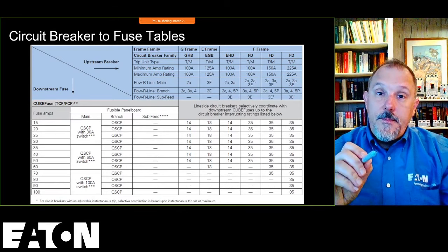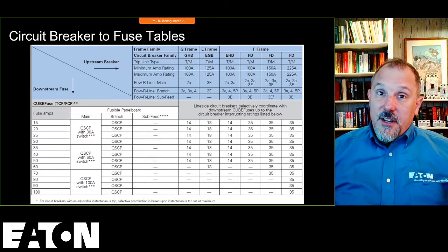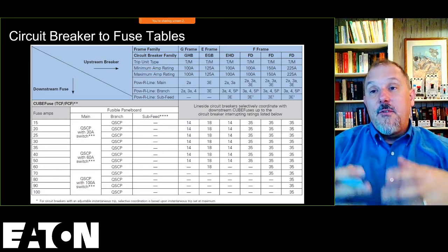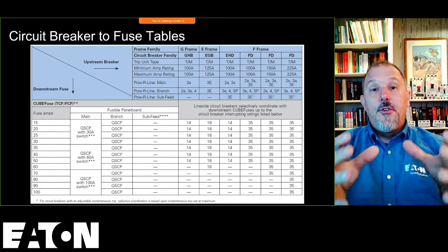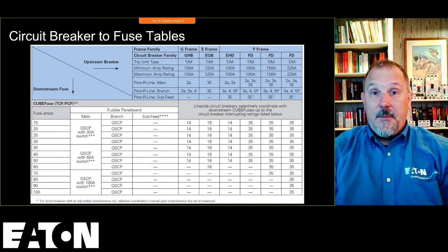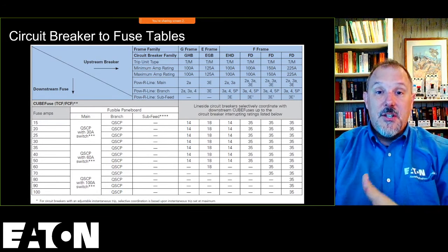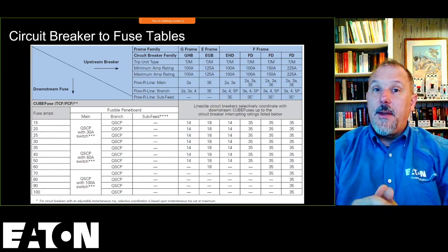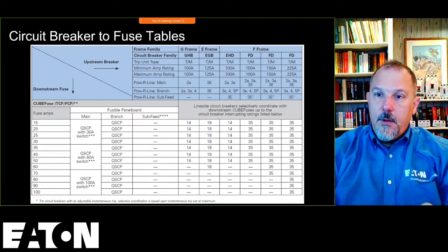Now, not all circuit breakers fit in all enclosures. So as you're going through the selective coordination process, and if you get into using the tables, or even if you don't use the tables, no matter what, when you're selecting a circuit breaker, you have to understand where in a panel board that breaker is going. Is it going to be the main in the panel board? Like